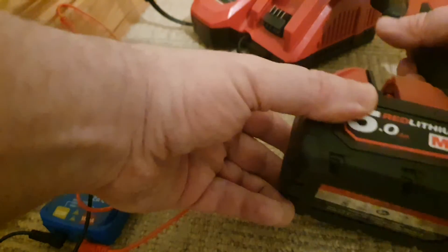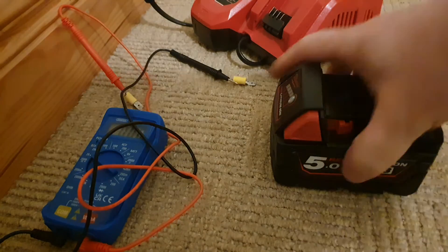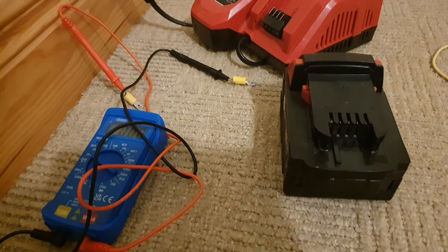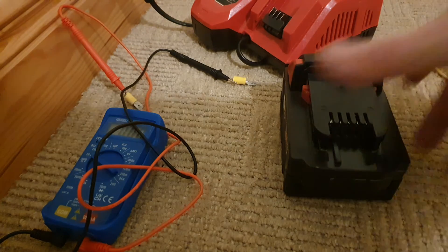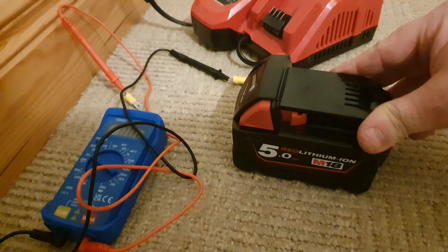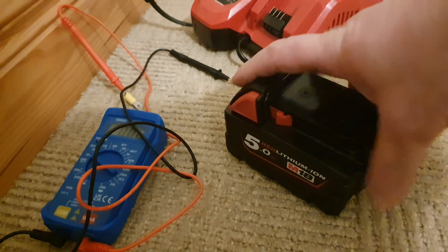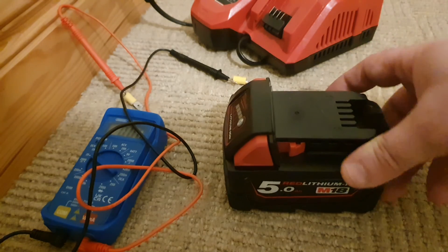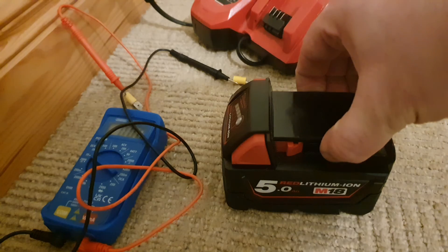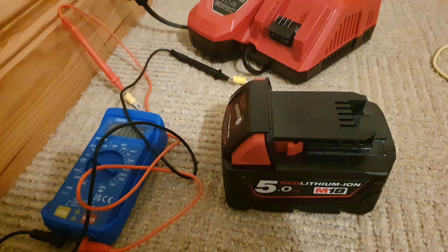I'm going to try it in a tool just to be sure. So if anybody tells you the jump-start method is a myth, they're wrong — though it's not always the best option. I'd suggest testing the voltage of the battery first. If you have full voltage and a failed chip, the boost start isn't going to do anything for you — it's only really for bringing up the voltage. The chip inside the battery and the technology inside the charger then recognizes it's there to charge. If you liked that video, please subscribe and check out my other content.